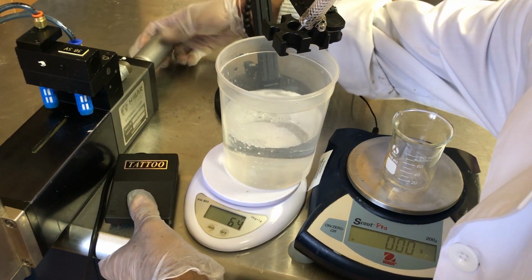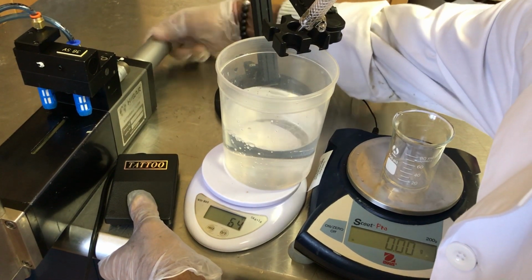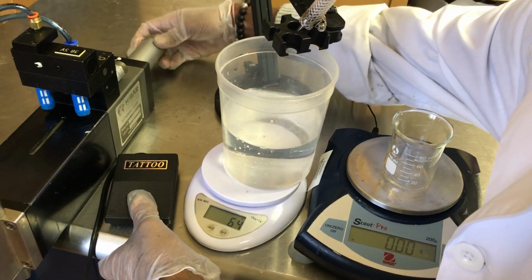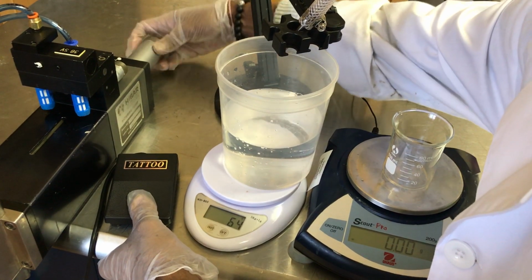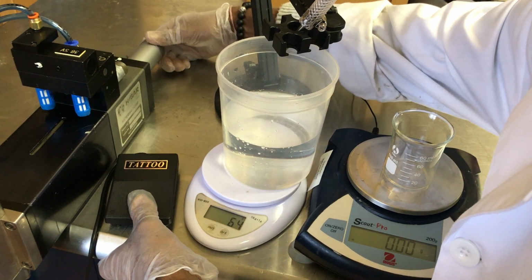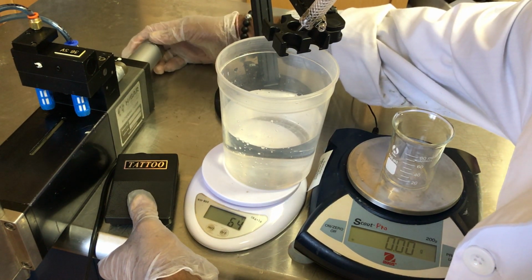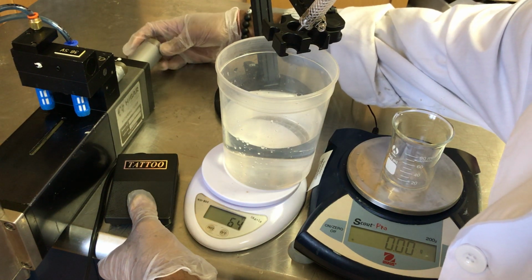And when you want to change the back, you have to hold down the foot pedal so that the piston isn't pushing on the back micrometer. It's a physical stop, which is part of why it's so accurate. It doesn't have electronics or anything like that involved in it. So for every number on the back, it goes up to 20, you get about 7 ml.